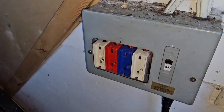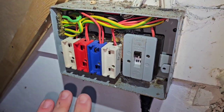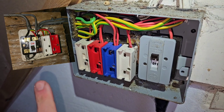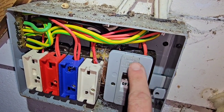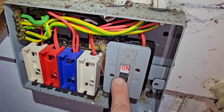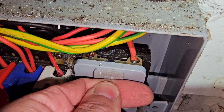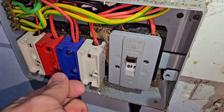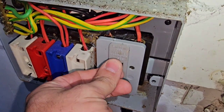I'm going to get the cover off and show you the inside of this fuse board — and here it is in all its glory. I'm going to put up a picture of an older Star one, and you'll notice that the switch is actually covered up on this one. On those other older ones, the terminals are completely exposed, so when you operate the switch — when you turn it off — you can end up slipping and touching that live terminal. That's such a dangerous thing, because you want to be able to turn it on and off when you're working on it.